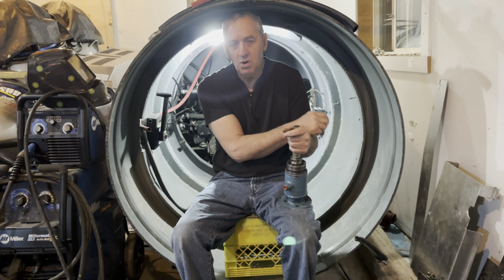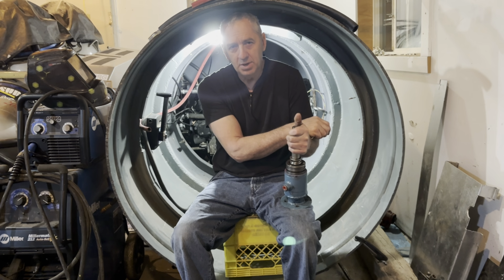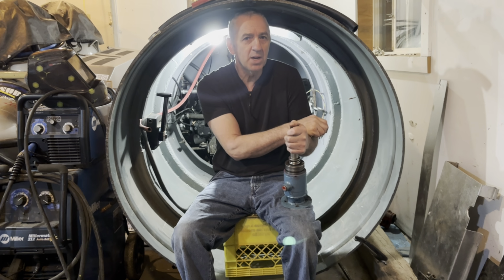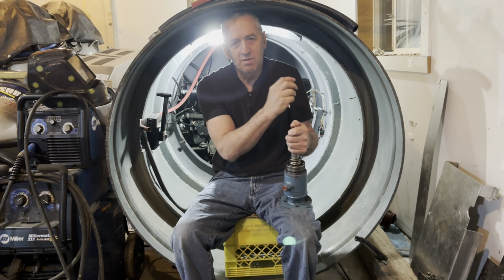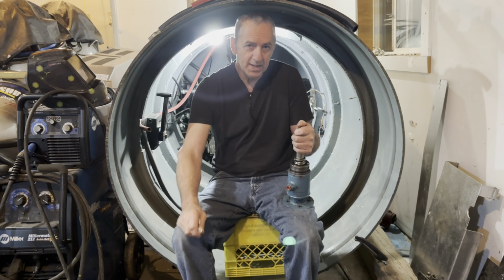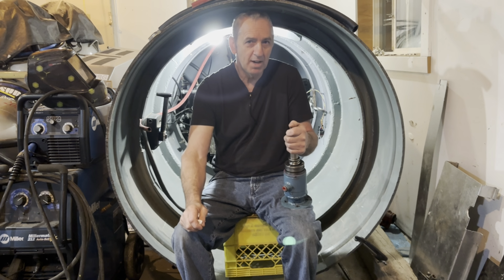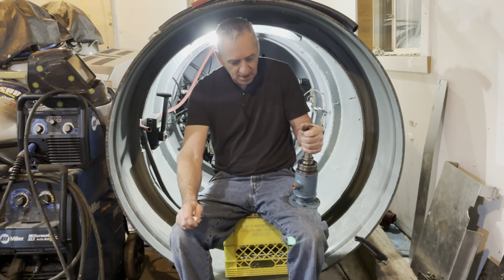I mean, you just don't know. I have to put a pressure gauge on the pump and just start from there. Put it in the water. I'll dig a test pool in the spring, put it in the water, and I'll just start testing. And whatever the gauge tells me, I know that I can't go over 1800 PSI, so I can just keep playing with pumps until I get the right thing. I don't know how else to do it. I don't have the math skills to figure it out otherwise. So that's what I'm doing. So anyways, that's what I'm working on.